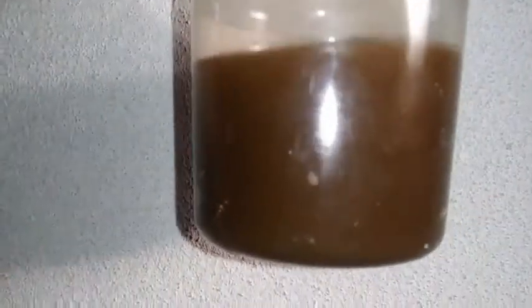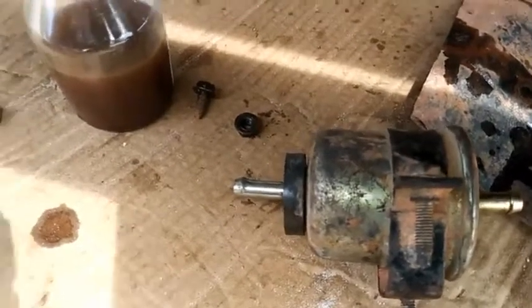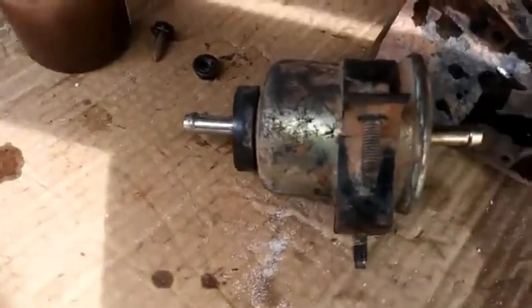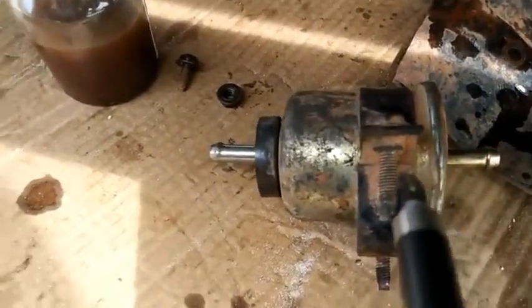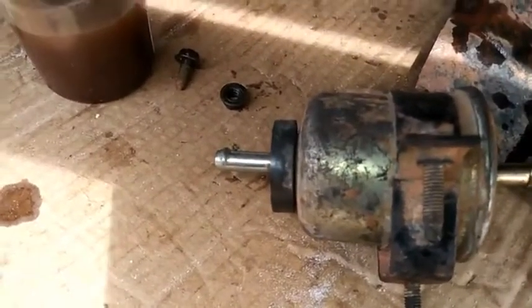This is worth investigating so you can know the condition inside the gas tank. Back-washing the filter requires you to blow into this side, which blows all the elements off the external side of the filter element.